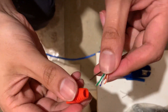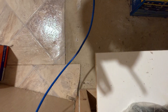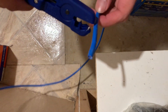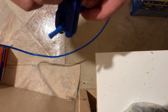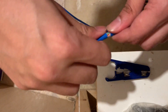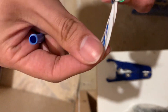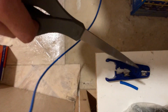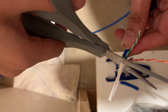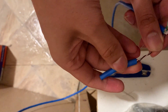The first step is to put on the cable boot over the wire if you choose to use them. Next, place the raw cable into the wire stripper teeth, spin it around about three times to cut the rubber exterior, and pull it off. This exposes the internal twisted cables. Then bend the twisted pairs downwards, grab scissors to cut the plastic divider in the middle and the small rope, giving yourself as much free space to work with as possible.